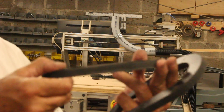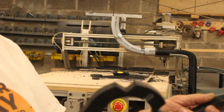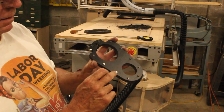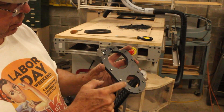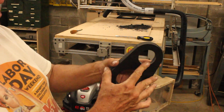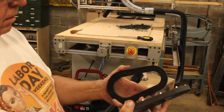Here are my two pieces. This one clamps onto the router itself and has the hose glued into it. Then this one has the sweep whiskers forced into it. The only other thing is we will put neodymium magnets on both pieces so they stick together. Here I have my neodymium magnets planted in there — I just drilled in a little ways and pressed them in. Now I've got the second course which will be embedded in the other half, stuck to them. I'm going to set the sweep onto it and come in with spray paint to spray the edge, and hopefully that will leave the impression of where the magnets are, then I'll drill the corresponding holes in this side and press them in.